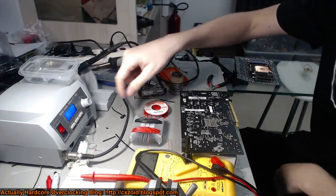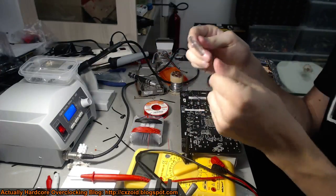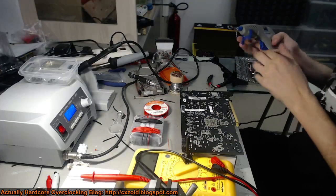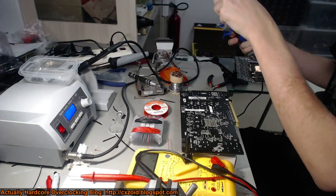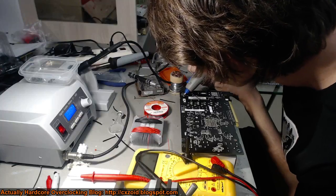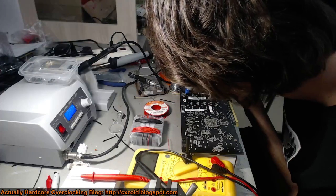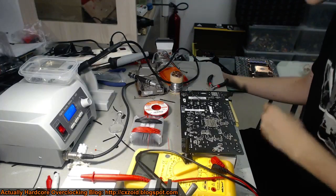Just visually check. If you can't see properly - and these things are tiny and obnoxious - you can use a magnifying glass to check it out. Now let's hit it with the hot glue, because that wire's going to come off really fast. Hit it gently - you don't want to force anything. Because if you separate that wire again, you're going to have hot glue on it, and that's going to make your life so much worse when you're trying to solder again.